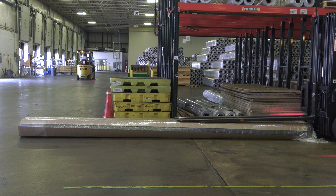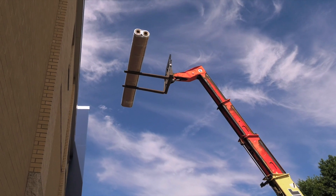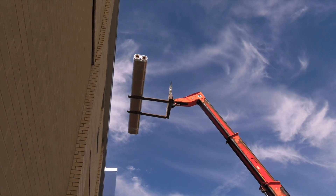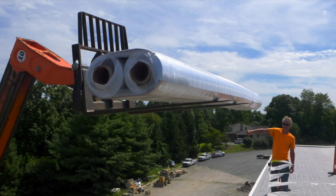When moving or storing rolls, ensure aisleways or storage and handling areas can accommodate 16-foot wide material. When unloading, use forks or straps to lift or crane two-packs to the roof. Follow all safety protocols for lifting and rooftop loading, including making sure loads are balanced before lifting.